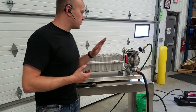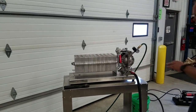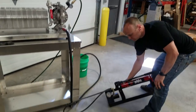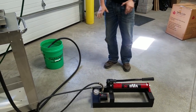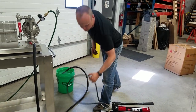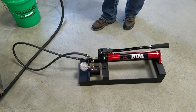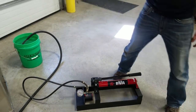I'm going to show you what goes on when we have our 4,000 pounds of pressure. After that I'm going to show you a device that pretty much eliminates that problem — it's a hydraulic closure device. This is a prototype; I suspect that the mass production units might be slightly different. The mass production units certainly won't have the six-foot-long handle — it's going to have a cleaner look, but it will have a pressure gauge which will allow us to monitor what we're doing inside the press.